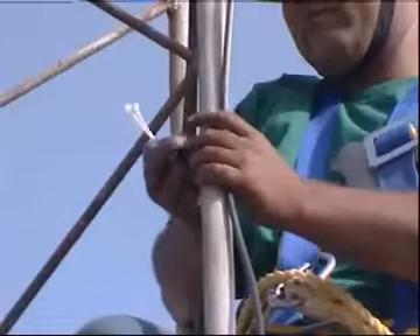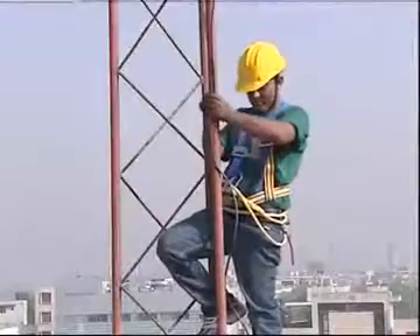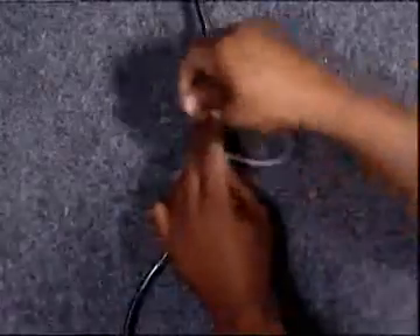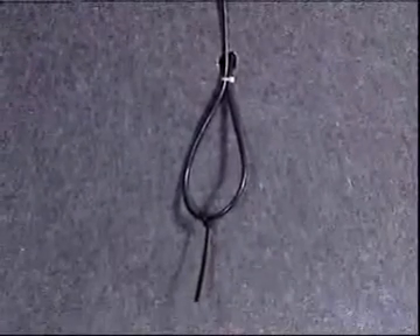Tighten the cable gland properly. To ensure hermetic sealing of the ODU, secure the cables to the pole, mast, or brackets using UV-rated cable ties. Make a drip loop on the cable at the entrance of the building or shelter, as shown in the video, to avoid seepage of rainwater into the IDU. Secure the cable properly along the cable tray.